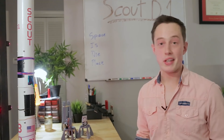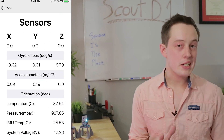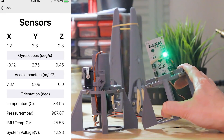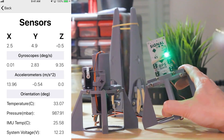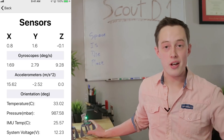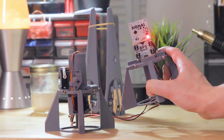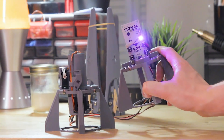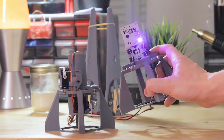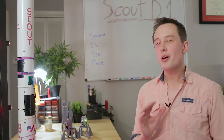I'll reboot the computer and demonstrate something else. Once again connected to the computer with my phone, but this time we're going to launch the rocket at an angle. I'm going to start to pitch it over a little bit, and you'll see all of these averaged accelerometer measurements starting to affect our orientation on the x-axis as we creep up to almost 17 degrees on the x-axis. I'm going to launch the rocket — three, two, one. The vehicle is actually trying to remain at this pitched-over orientation. If I go back to upright, it tries to correct back to that 17 or 16 degree angle. Let's think about why this actually happens.